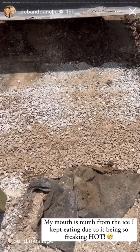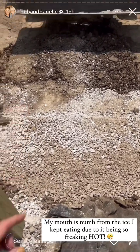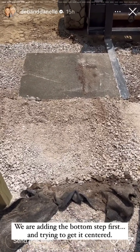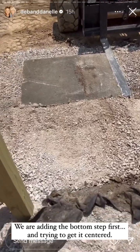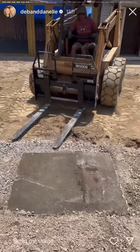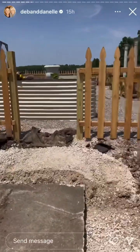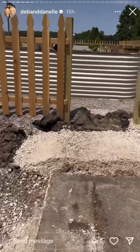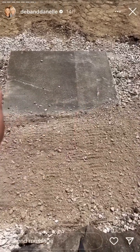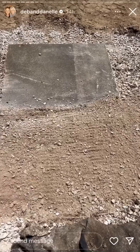Here's how she's doing it — she formed this little step, put packing stone on it, then there's another step down and now she'll go get one of those pieces. This is the first step — the bottom. It's level, that looks good. It's level — perfect this way and it goes a little bit forward, which is what we want so the water runs off of it and doesn't run back between the steps.